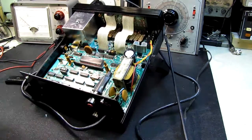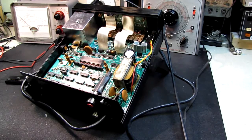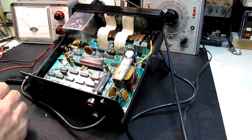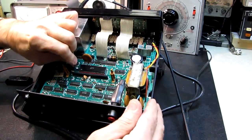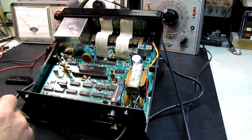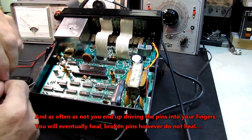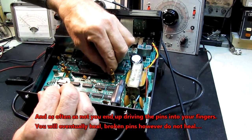Sometimes it pays to hold on to the crap. Now I should unplug this, and somewhere around here I should have some IC pullers — yes I do. Let me see if I can carefully lever this chip up. You never want to try to pull these up from one side with a screwdriver or pull them out by hand, because it's guaranteed one side will let go before the other and you'll end up bending or breaking pins.